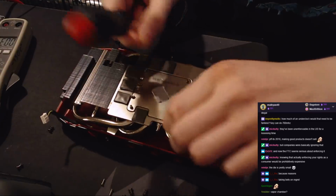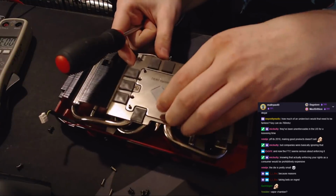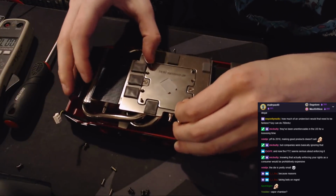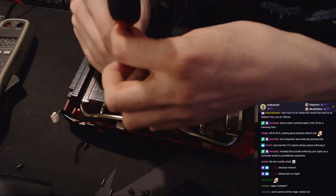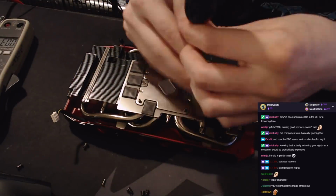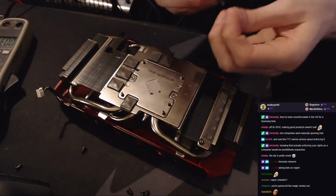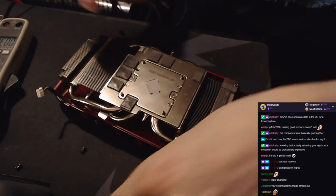Okay, no, it does seem to actually be soldered, and that is just structural rigidity. Yeah, no, okay. I was worried they were using thermal paste. If they were using thermal paste, I would have killed them. Well, no, but I would have just gone and probably said how Powercolor doesn't know how a heatsink is supposed to work, but that just seems to be a structural rigidity thing. Which is fine. That's actually a good thing. But yeah, that's odd.